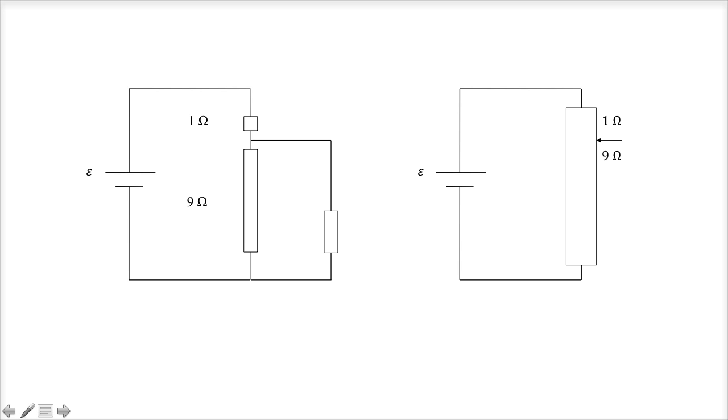Now we're going to connect another device in parallel with the bottom. So how do we draw that over here? You simply connect to that arrow. The arrow here does not show which way current is going. Current is flowing out of here. It's passing into the potentiometer. It splits. Some goes this way, opposite the arrow. The rest goes down this way. The same exact scenario as what you see on the left. There's a junction where the current splits, and then it joins back up at the bottom, right here.